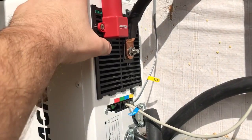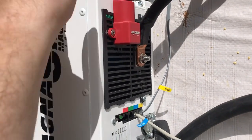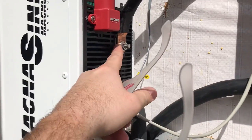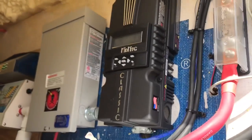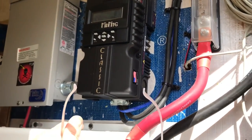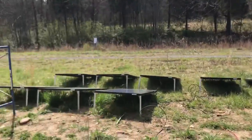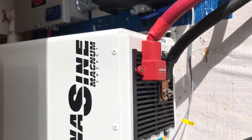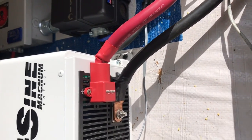Everything you do here is at your own risk — don't hold me liable, I just know this stuff works in the field. If you ever have a solar system that needs a jump-start — like you'd start a vehicle — to get the charge controller system actually charging the battery bank again, you put your negative clamp here and positive clamp there. This Midnight charge controller, I believe when it registers around 10 to 12 volts, it'll turn on, start charging, and re-engage your solar panels. So if you've drained your 48-volt or 24-volt bank all the way dead, or left it in the cold, this is a quick fix to get you back online.